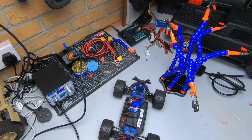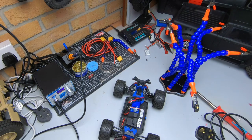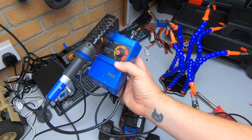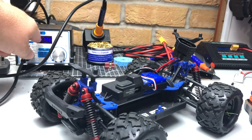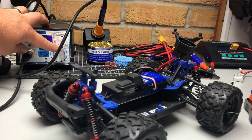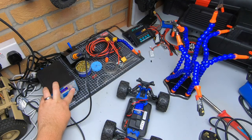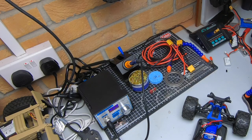The first thing you really want to be doing is looking at what solder and iron you're going to use. You can get these cheap ones — this is a 25 watt iron. This is a 50 watt with some adjustable temperature — no gauges, just a colour graph so you can adjust the temperature. And then we've got this one here which is 75 watt with variable temperature all the way up to 480 degrees centigrade, which is 900 Fahrenheit. I always set it to 400 — that's my magic number. Some people might argue that's too hot, but for me that's what I work with. It will take a little bit of practice to work out what's best for you.